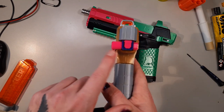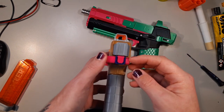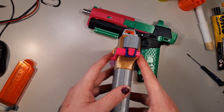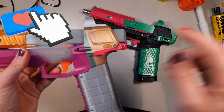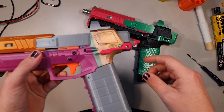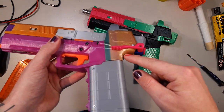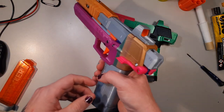In this configuration the setup is only right-handed, but you can flip it — I can print the parts differently so you have the lever on the other side for a purely left-handed setup, or you can have two levers on either side for an ambidextrous setup. It uses a little bit more hardware because the two parts have to go together, but it uses the same hardware as the Gecko: a heat insert and a 30mm M3 screw, plus one spring which is actually the same as the catch.